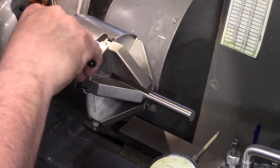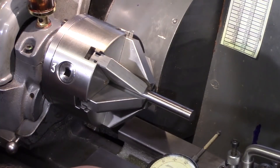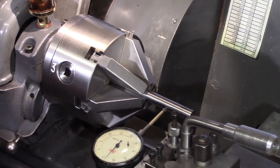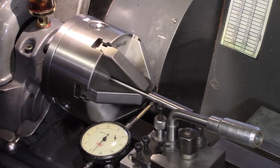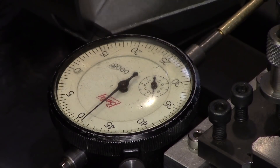So I thought I'd try it again. I tightened them up in order one, two, and three with just gentle finger pressure. Bingo! The chuck was actually now running at approximately one and a half thou out.